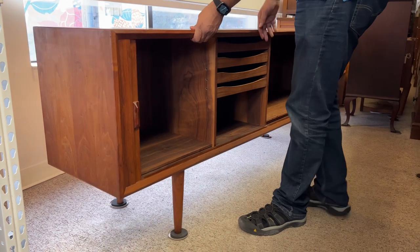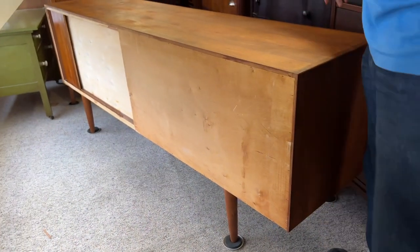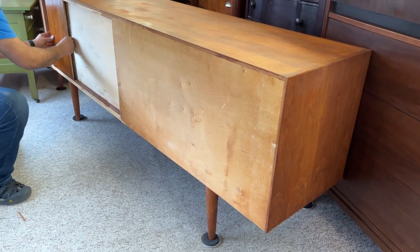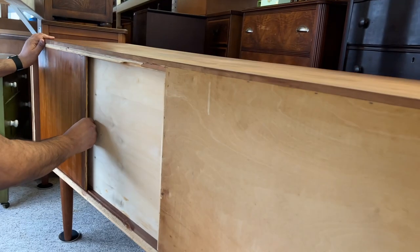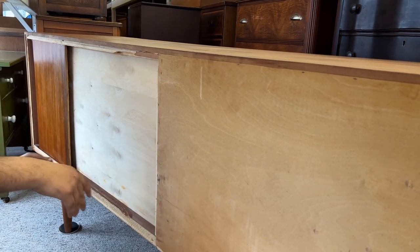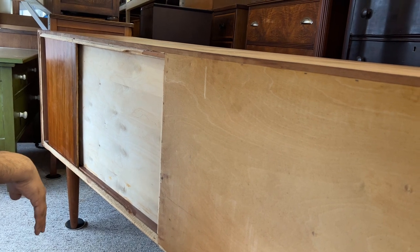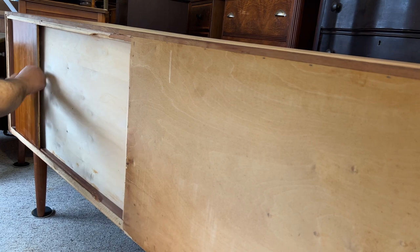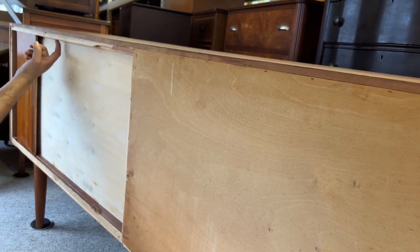So I'm going to quickly show the back of it. I did some work ahead of time to figure out why the door was sticking — I had to remove the back panel. Right when the door gets to about here, the tambour door is a little tight, sticking right here. I initially applied some silicone grease because I thought there might be some gunk buildup, so I vacuumed the tracks and applied silicone grease from Rockler. But that didn't help much — it was still sticking. I was messing around with it and I could hear it binding on the top and bottom right here.